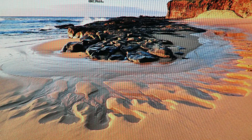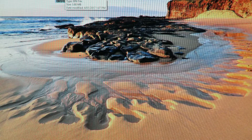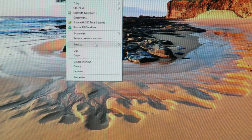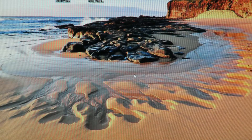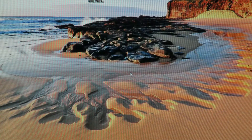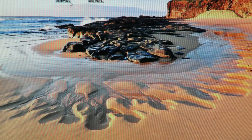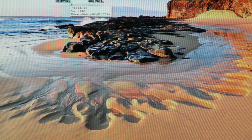This is the file I'm interested in — it's the .bin file. We have to copy this over to the root directory of the SD card. My SD card is already in the reader, so an easy way of doing it is just 'Send To' — there's the SD card on the D drive — copying it across.